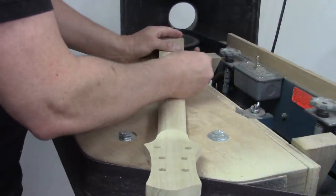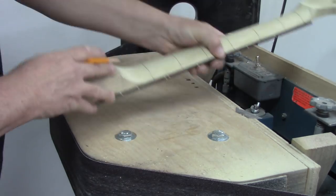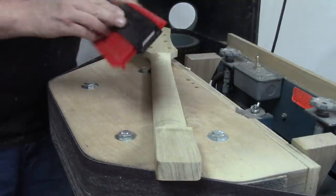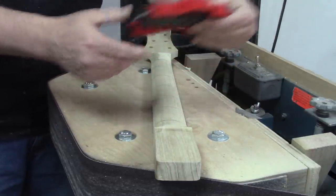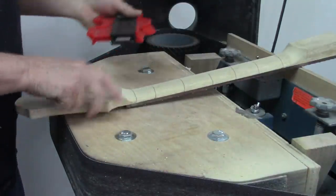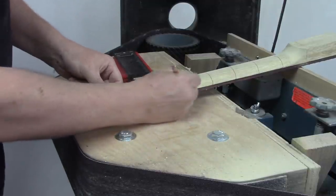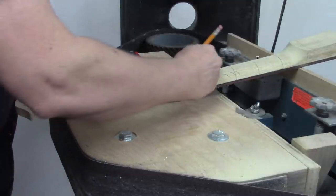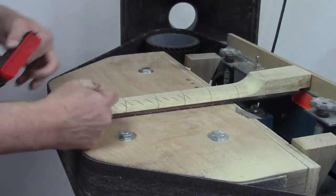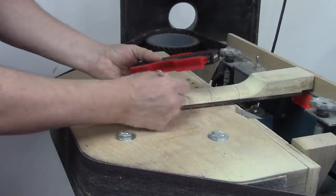Constantly check this, especially when you're in the air. When you first start using your deadhead sander, constantly be checking and know when it's a good time to stop and switch to hand tools. I think I'm getting pretty close, but I still have kind of a flat spot in the middle that I'm not super jazzed about. So we're going to address that. I need to take more off of this spot right here — I need to make these pencil lines go away, and it looks like I haven't gotten this chunk down yet where I need it to go. I need to take way more off of this side here.